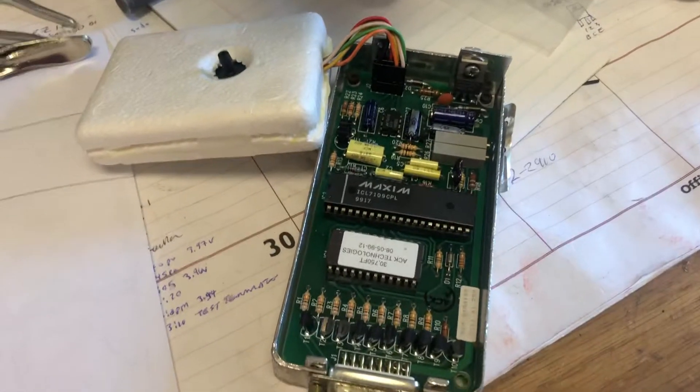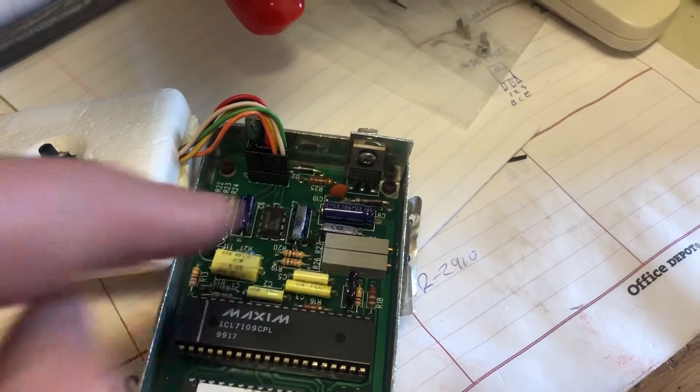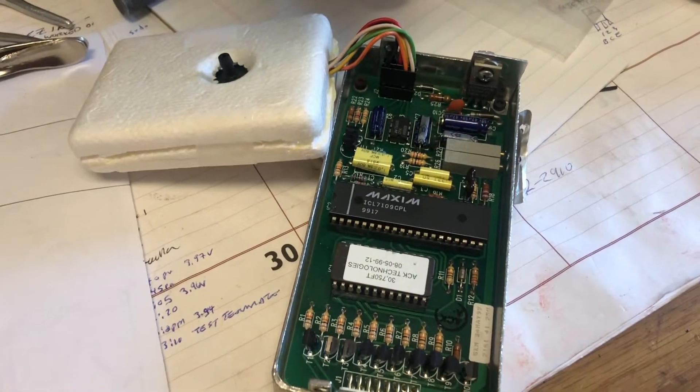That's how the system works, and right now it appears to be working. These two pots — the high altitude and low altitude pot — need to be adjusted to be calibrated. I wouldn't trust it without checking it on the bench first with a pressure source.